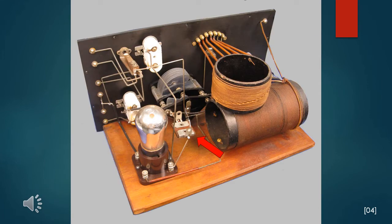The set uses two Allen-Bradley brand compression-type carbon disk pile resistors mounted to the front panel: one for filament voltage control called a Bradley-ohm, and a multi-mega-ohm unit called a Bradley-leak for the detector grid-bias resistor. It might look as if there is a missing grid-leak resistor across the fixed capacitor highlighted by the red arrow, but the circuit does not use a multi-mega-ohm resistor across this capacitor. These grid-leak resistor clips were commonly supplied riveted across this particular value capacitor. The Bradley-leak bias resistor is connected between the tube grid and one side of the filament.